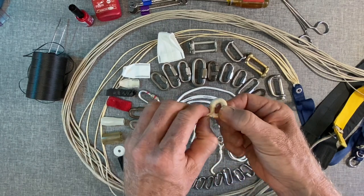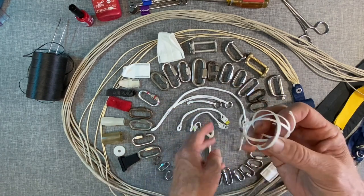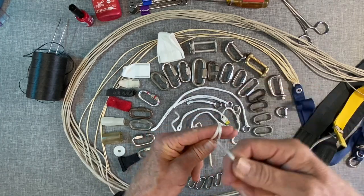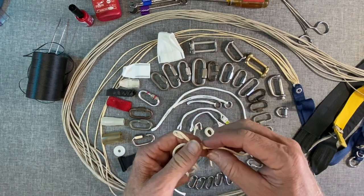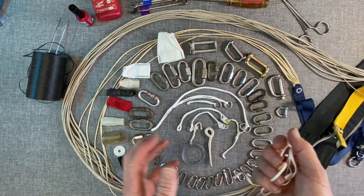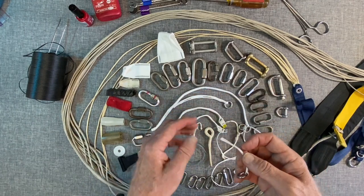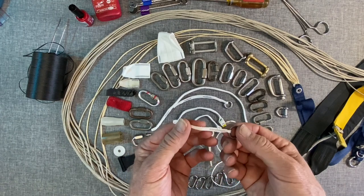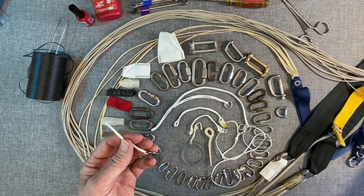Eventually I got a bit tired of finger-trapping inside a finger trap and changed to just using normal Dyneema line, wrapping it through the lines and through the risers several times and then tying it off with the surgeon's knot, finger-trapping the tail ends and hitching it over. It seemed to work great. The very first removable, reusable, convenient soft link was Parachute de France and it was quite a tight fit — a very clever, innovative idea.